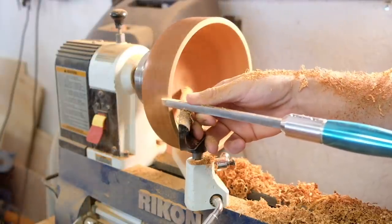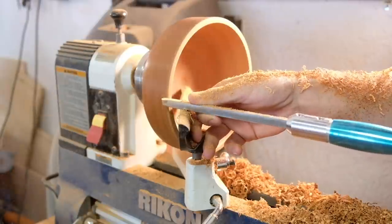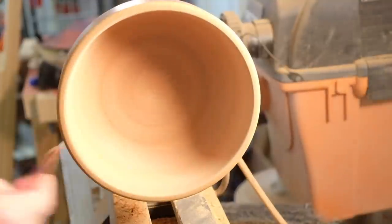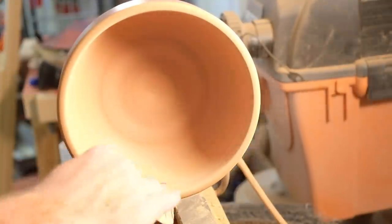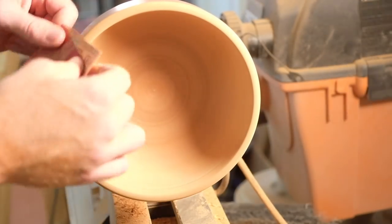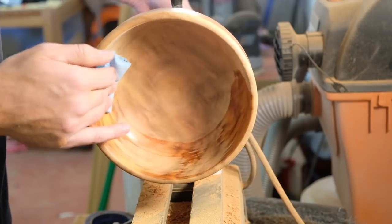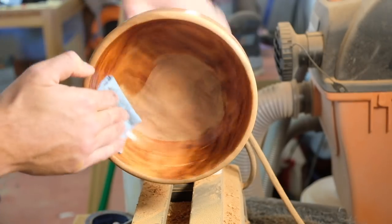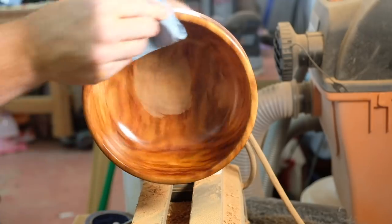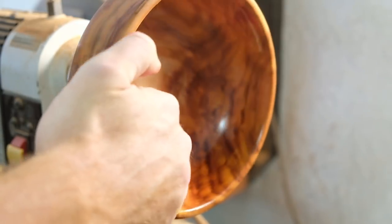The tool rest is straight and can't give me access to all parts of the bowl, and because of this — in addition to me being rusty — the tool finish on the inside was nothing to be desired. I started sanding at 80 grit and worked my way up. The inside still has some tool marks and a few ridges, but I'll get better next time. I added some more walnut oil and watched the rest of the grain come alive. This walnut oil is made and sold by Mike Mahoney, who is an amazing bowl turner. It's a really nice finish, pretty light duty and also food safe — affiliate link in the description below.